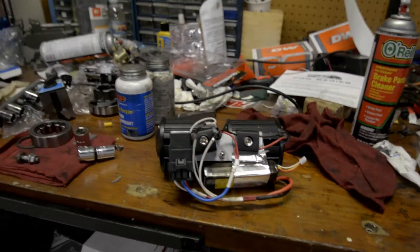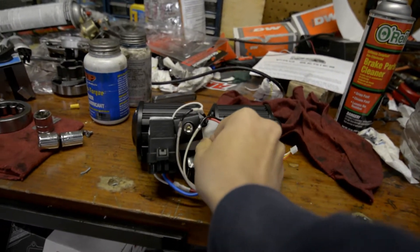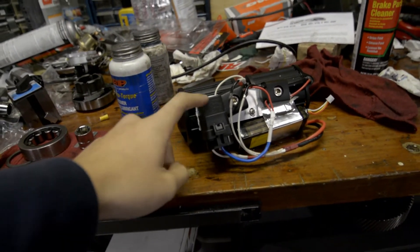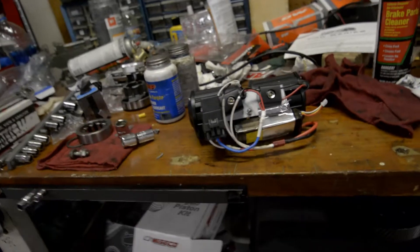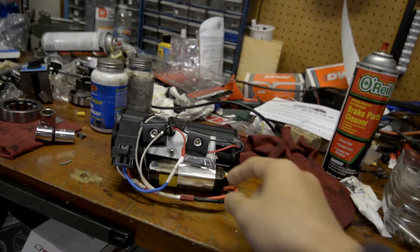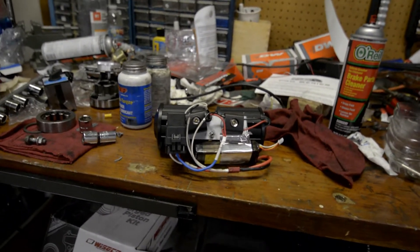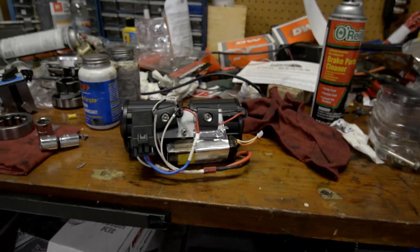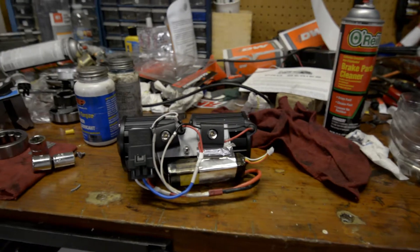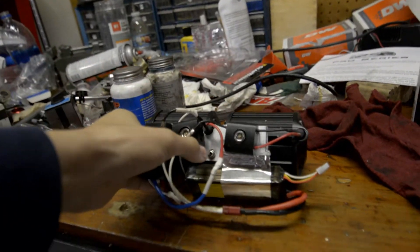How I did the wiring is pretty simple. There's a little switch right there to turn it on and off, and then an automotive relay — this is good for 25 amps, so that's plenty more than what I need. I have a lithium polymer battery which is 2.2 amp hours, so it doesn't last too long — maybe 10 minutes of continuous usage. But if I wanted more life I could just get a sealed lead acid battery and that would solve the problem. There's a little switch on the top too.